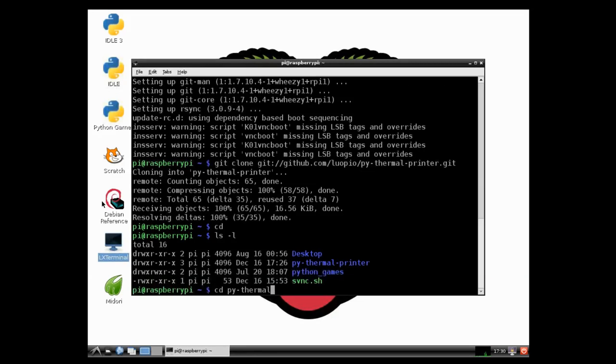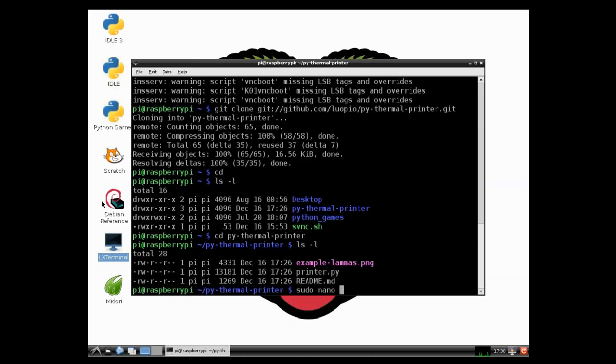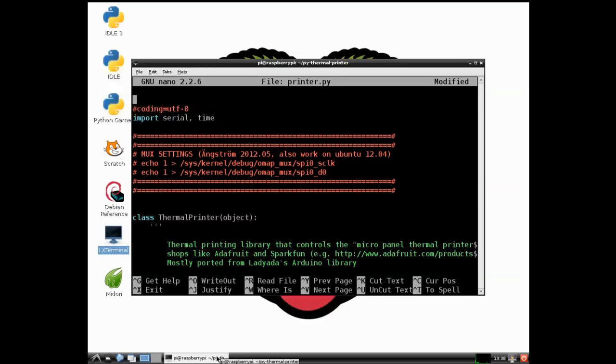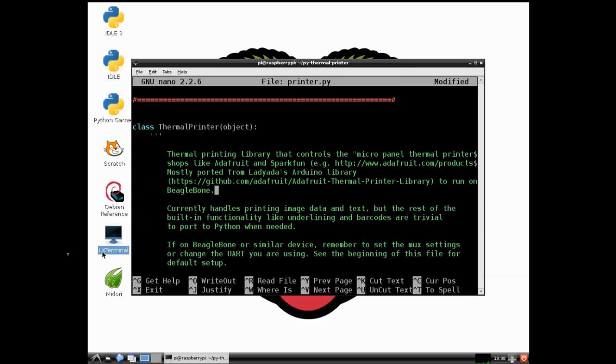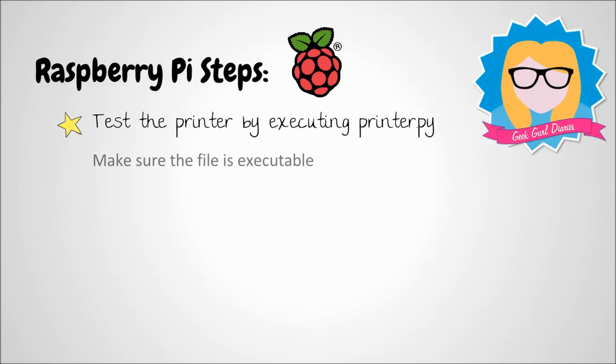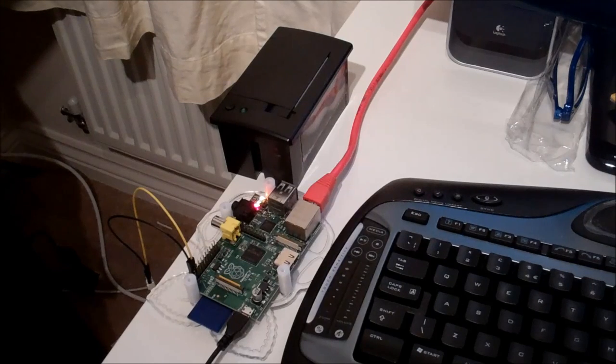I like to check that all my files are there, and then I'm going to change directory so that I'm in the directory where my Python file is for my thermal printer. We're going to have to adapt this piece of code very slightly — we need to put in some information at the top and make sure it's using the right serial port. Firstly, at the top, making sure it's going to be able to read the Python file by typing in this code. And secondly, I need to make sure it's using the right port — and it is. We've now got to the point where we can test our printer by executing the Python printer file. We need to make sure we give it some permission, then we just execute the printer.py file.